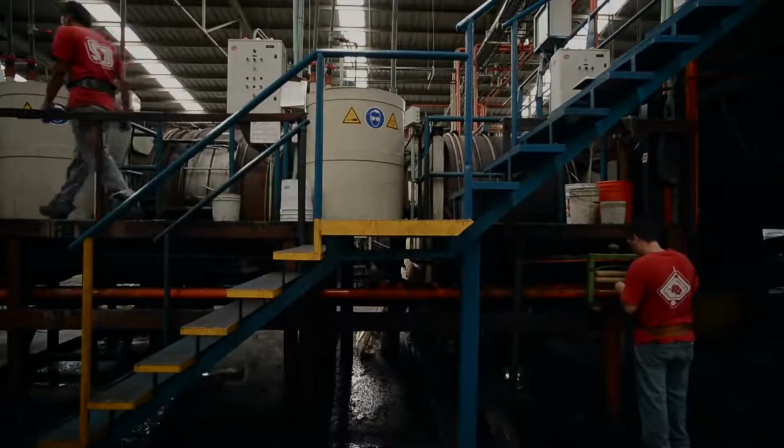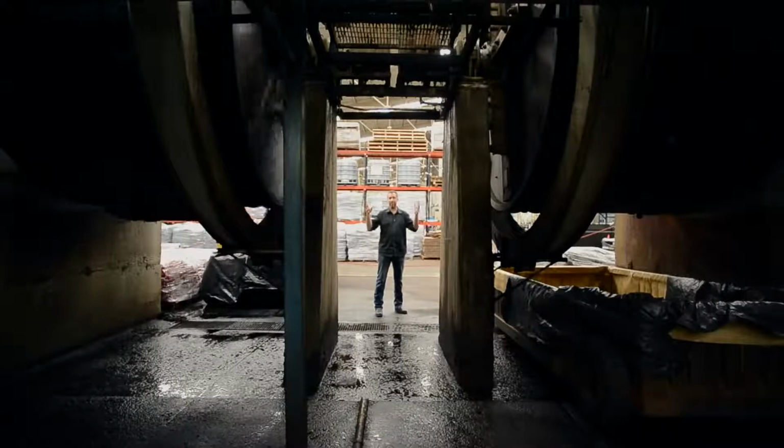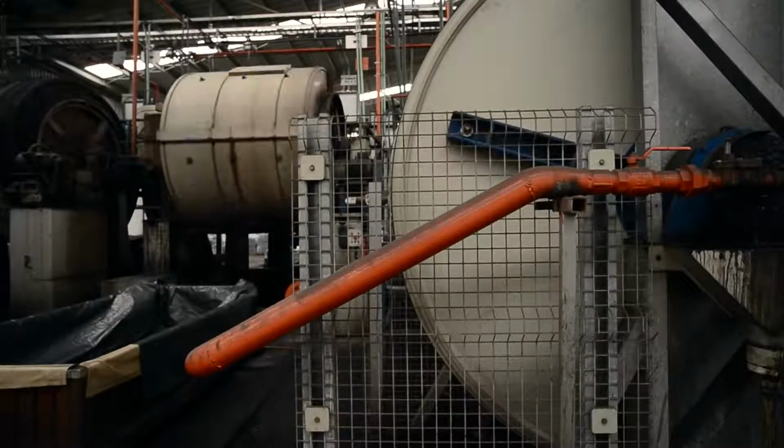So this is the most important part of the tanning process. They'll tan it for 8 to 10 hours in these things, tumbling them. They throw the wet blue in here, they throw in the water-soluble dyes, not the lead-based or any dangerous ones. Then they throw in tannin, which they use for vegetable tanning. And then they throw in the highly refined oils. They dump them in here and they tumble for 8 to 10 hours. And so that way all of those oils, all the tannin, all of that stuff gets all the way to the very center of the hide.